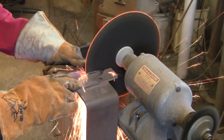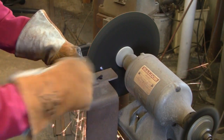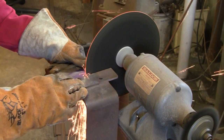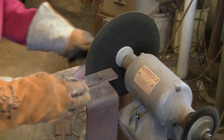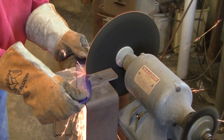If the blade gets a little hot on you, just have a five gallon bucket of water there and dip the blade every now and then. As slow as I'm going cutting that out, I've got insulated gloves on and pretty much just keep going.